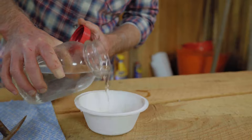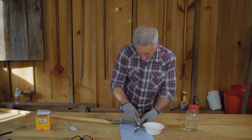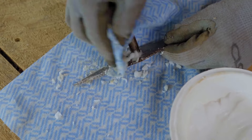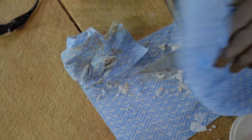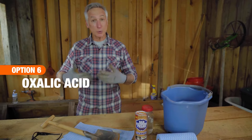For smaller areas of rust or rust stains, baking soda can be an effective option. Clean and dry the tool, degrease it if necessary, then mix baking soda and water in a bowl to make a paste. Apply it to the rusted areas and let it sit for a couple of hours. Scrub the paste away with a brush, rinse with clean water, and dry.